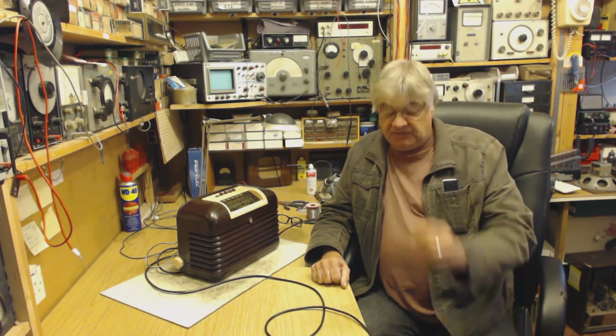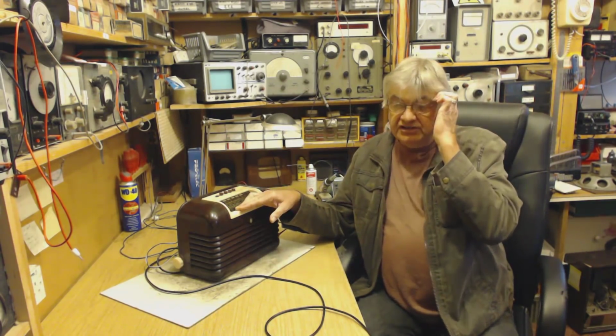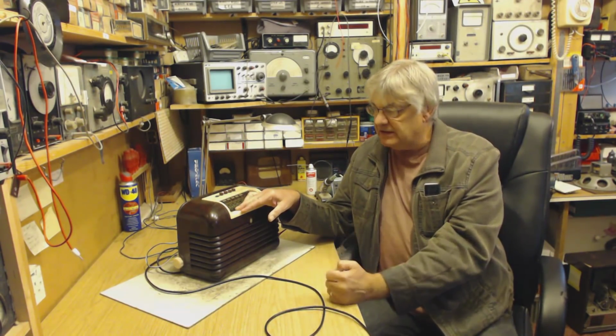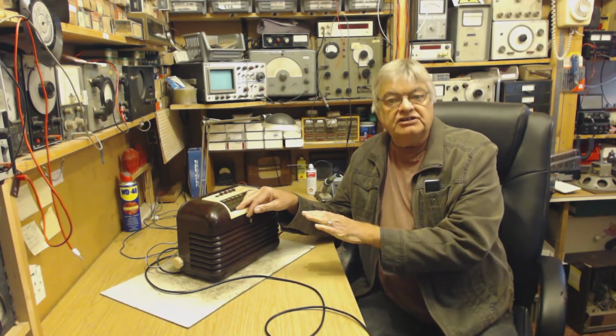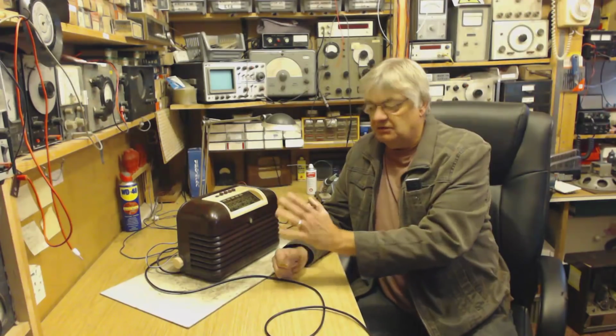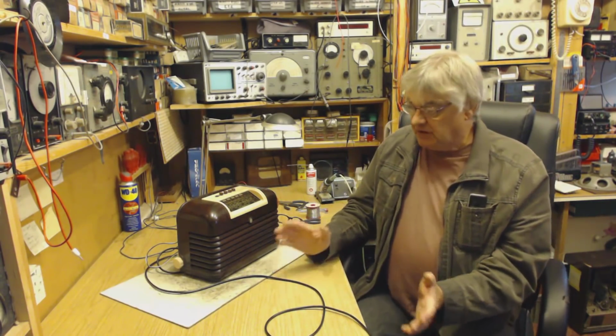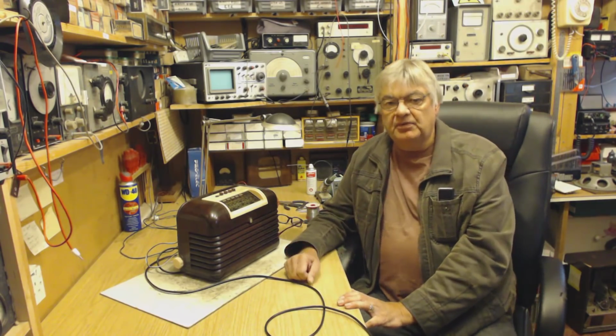Okay, does that matter? As far as the electrical safety is concerned, no. Very low resistance wiring if it's wired properly. Very low resistance path to earth. Any problems, it'll blow your fuse. Brilliant. As a safety earth, which it's meant to be, perfect. So what's the problem?